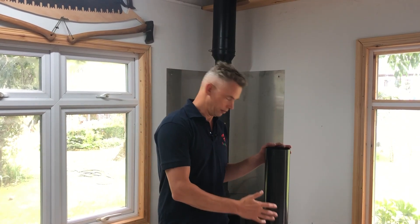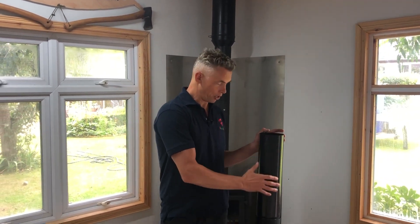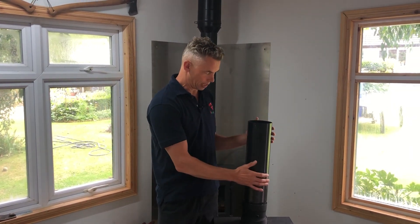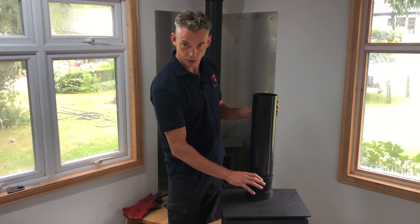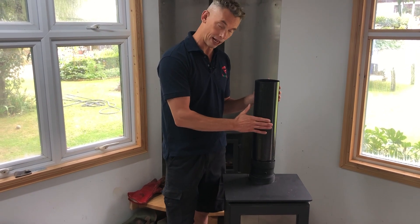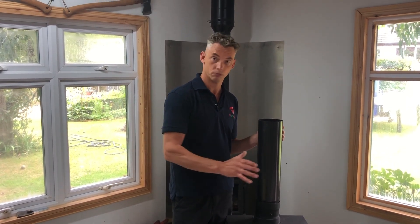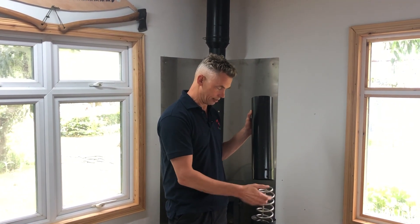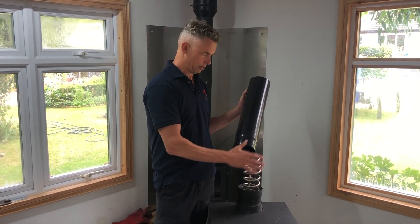You need to be competent and careful, but that's largely because you need to be able to check the existing flue to make sure it's working properly. If your stove and flue are balanced, the bottom metre or so should be burning clean, so there isn't soot collecting in this area. But if the flue isn't working properly you get soot collecting down at the bottom — it's not generating enough heat through the stove and into the flue section to burn it off clean. If that's happening your installer needs to fix it, or don't fit the ECO heat, because where there is soot collecting the unit is an additional surface and will soot up and block up just like the flue.